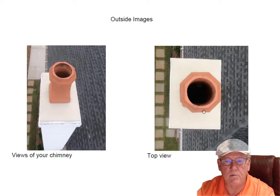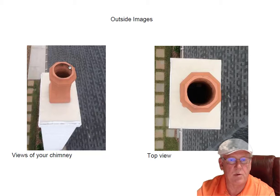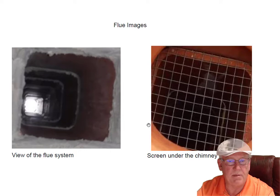Up on top, we like the way it looks — it's a beautiful chimney. A good alternative would be maybe a standard cap. Remember, chimney caps are not code-required in the state of North Carolina and don't have to be installed, but they do keep water out of the system. A traditional pot cap will keep water out and keep birds out — a great alternative to the screen. Because even if the creatures don't nest on top of it, the screen creates drag. The state of North Carolina says if you're going to use screen, you need to use four times the size of the opening. This screen is clearly only one times the size of the opening, so it's going to cause drag and cause smoke to come back into the house.